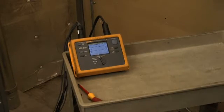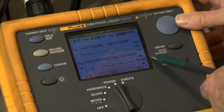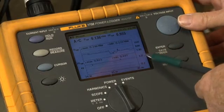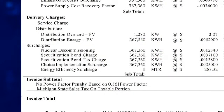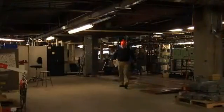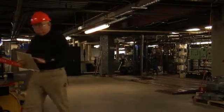When you are done logging, come back, terminate the recording, and check the data on your logger to verify you collected the data you wanted. Review KW, KVA, KVAR, and most importantly, power factor. A decent power factor value is usually 0.9 and above, but it depends on the utility. If power factor is bad but power demand is low, the utility probably won't charge for it, and it's not worth fixing. If you have bad power factor and high demand, your next step is to find the problem load.